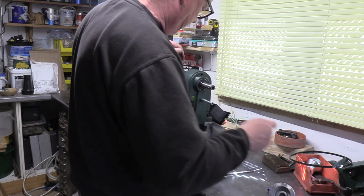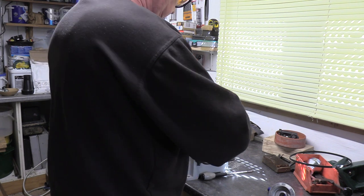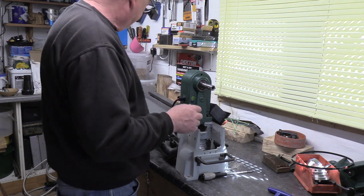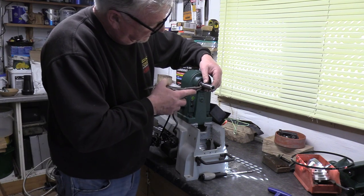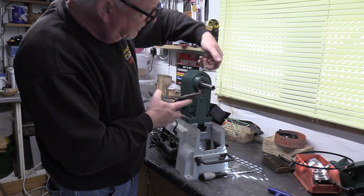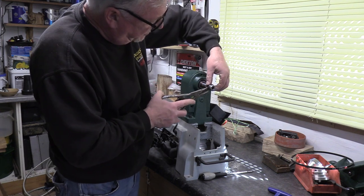What I might even do is take this shaft out of the way so when I'm knocking it out I'm not going to get my fingers bashed. I've got a circlip on there. With these things it might come off first time or it might be a bit of a fiddle. What I normally do is open it out and try and put my nail underneath the side of the circlip so when I've got some opening on there I can pop it off.